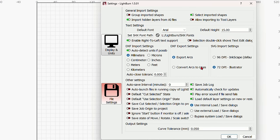If I just move this one down here so that you can see it better, if I come in here and I take off the arrange long, well, that's all you're going to see is these right here. So I like to have all of the extra advanced arrange long features. So I will turn off arrange. See how that disappeared? And I will turn on, I'm just right clicking on this white space right here. Right click is the shortcut menu in most functions in Lightburn. So I'm going to turn on arrange long now. And you'll see that I have a lot more icons in here for positioning and so forth. So I want that arrange long. I'll now put it back up there.